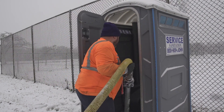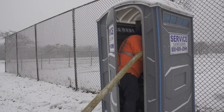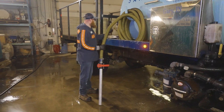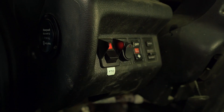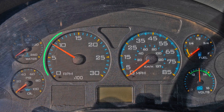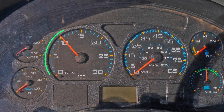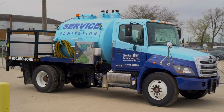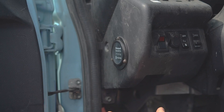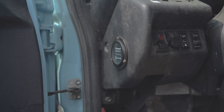A common issue that can often occur on older trucks with older vacuum pumps is low suction. Unlike the newer trucks in our fleet, they are not equipped with an automatic PTO governor, which throttles the engine up automatically when the PTO is engaged. To rectify this issue on older trucks, we'll first need to put the truck in park with the parking brake on, and then activate the truck's PTO.